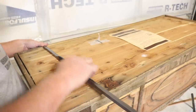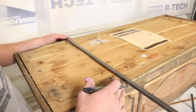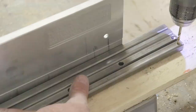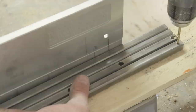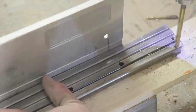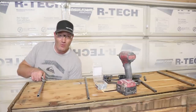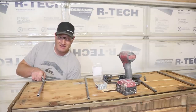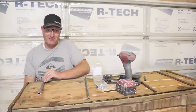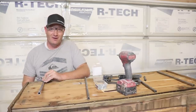I'm going to measure this square stock from the front of that line I just drew when the lid was closed back to right there — I may have to trim it down a little more and use an angle grinder to zip that off. Now I'm drilling five 5/32" holes along the half-inch square tubing, going through both sides. Then I come back in with a 3/8" bit on the top so the screw head can fit down through and I can get maximum depth. Now I know some people are going to ask why I didn't just rebuild the top out of plywood and put the trim back on — and yes, that would have been easy — but I want to save this cedar lining on the inside, so I'm stuck doing it the hard way.